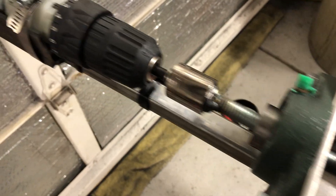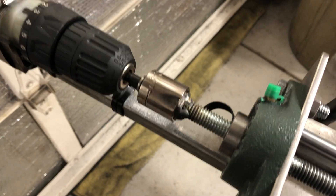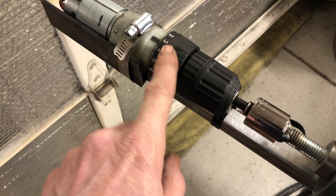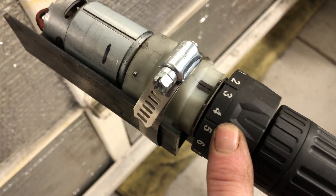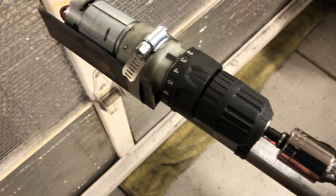It's on wheels too. Down here, same half-inch bearing — I put a socket with a little float so it's not binding. I'd recommend a drill with a clutch as an added safety feature. You can see I have the clutch set on three, and you can literally stop this with your hand — that's a testament to how smooth everything runs.